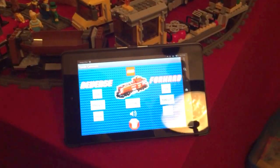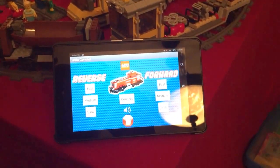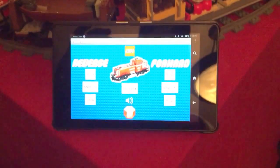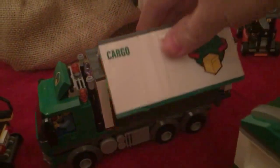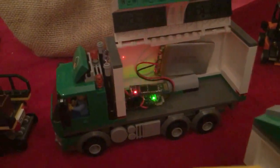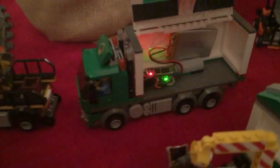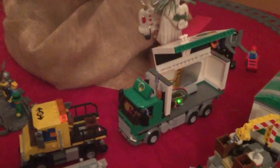What I thought would be fun is if I was able to make an app on MIT App Inventor — and I did that. Basically what this app does is it controls an Adafruit Pro Trinket connected to a Bluetooth receiver that will talk over serial to the trinket. And I have it powered by a LiPo battery in here. I found a nice cargo van Lego model that houses it all.